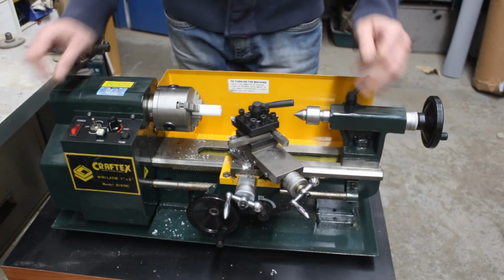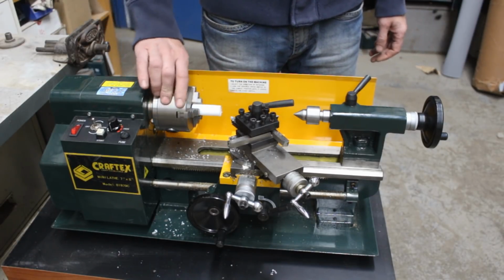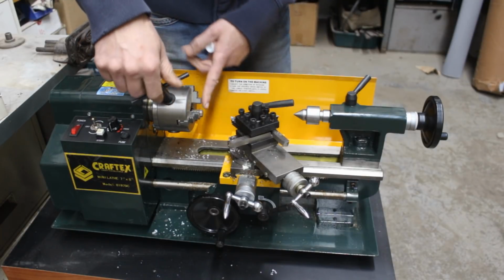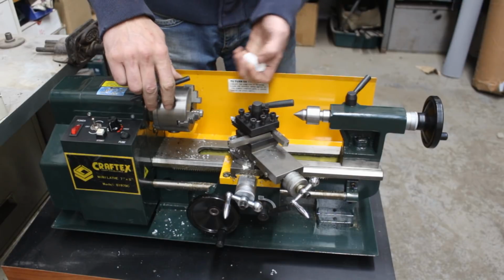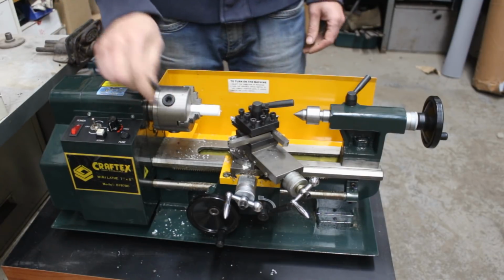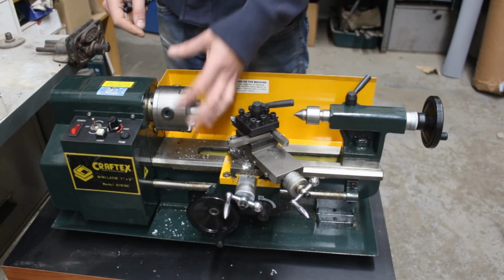And I'm really happy. It has a 3-inch 3-jaw chuck, but I just got a 4-jaw chuck too, because there is some difference between the 3-jaw and 4-jaw. The main difference is that the 3-jaw chuck is self-centering, which means that the 3 jaws move at the same time, and it's also referred to as universal. The 3-inch 3-jaw universal chuck, and the 4-jaw has 4 independent jaws that you can adjust separately,